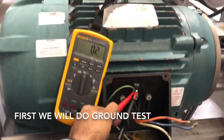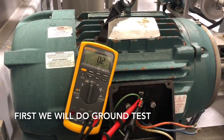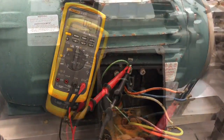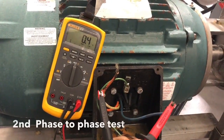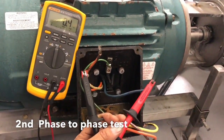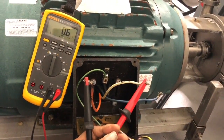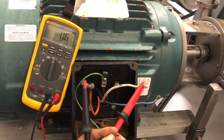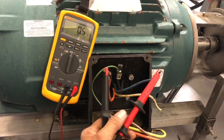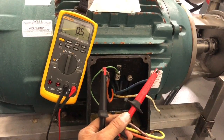I'm going to verify my meter one more time — with both leads shorted it reads zero, so the meter is working fine. The next step is to troubleshoot phase to phase, to check if any motor winding is open. I will test all three phases against each other to make sure the motor winding is connected. A low reading means the winding is good; a high or overload reading means the motor has an open phase. At this point my motor is perfect — not grounded and not open phase.